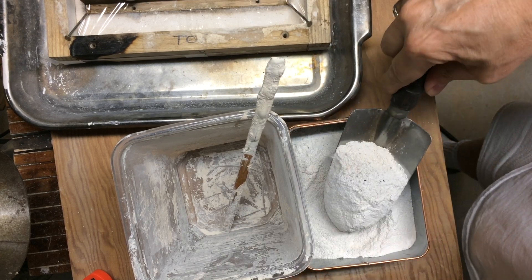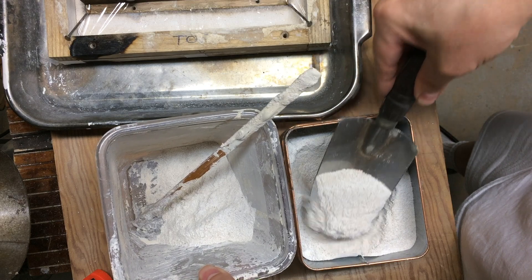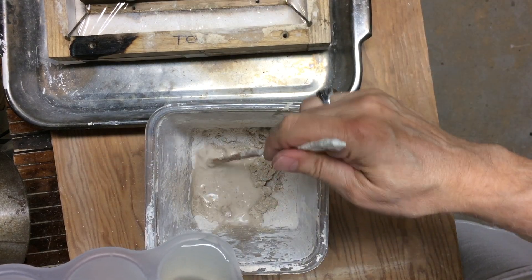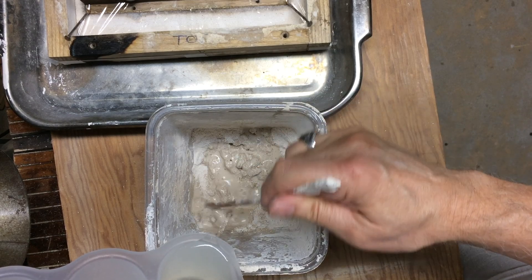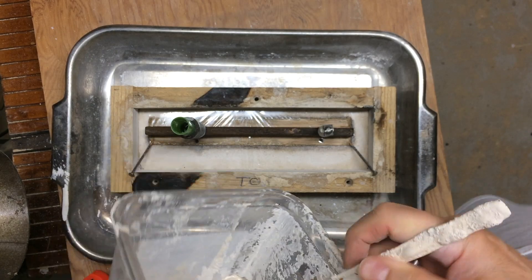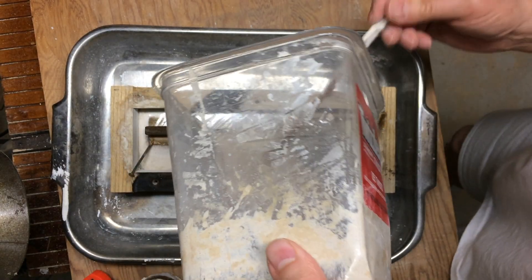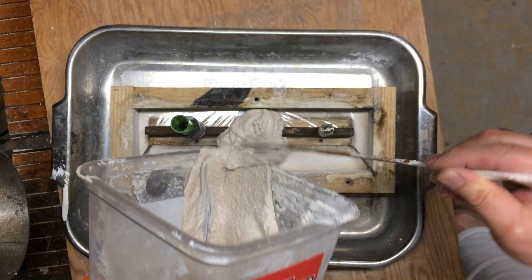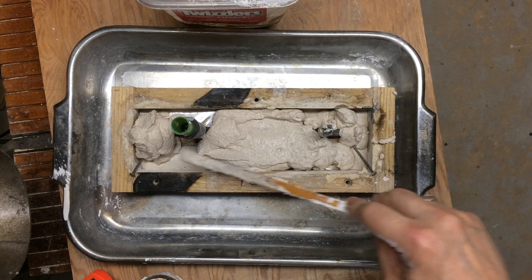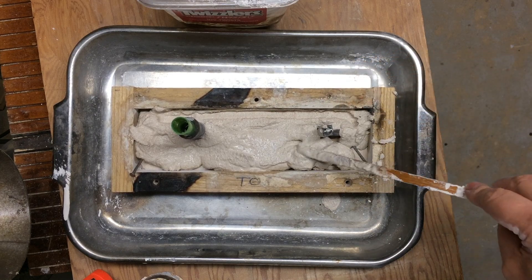Now I'm going to put a few scoops of plaster into the mixing bucket — one, two, three. This is plaster sand. Here we're just putting in some water that we used to soak the mold pattern, reusing that water to mix up our plaster. Once you get the plaster to a consistency you can work with, you can just spoon it in. Start covering the mold, putting the plaster gently around the nails — we don't want to disturb them. We want to get it packed in tight around all the parts of the pattern where we want the metal to flow.